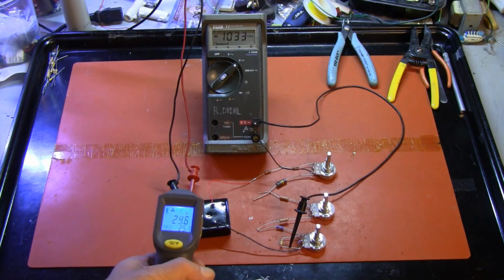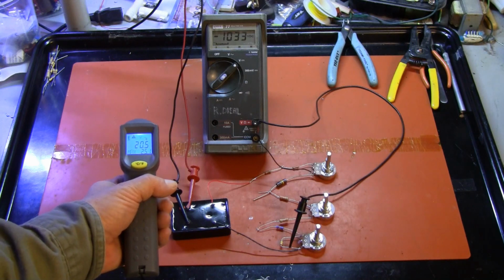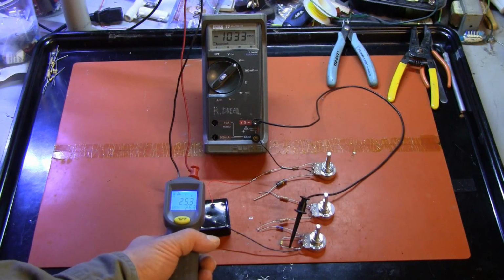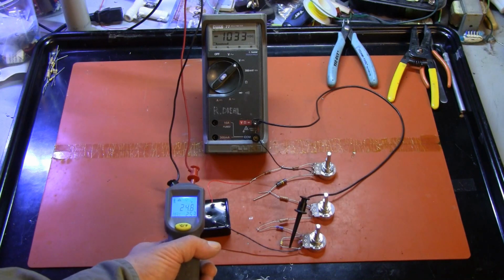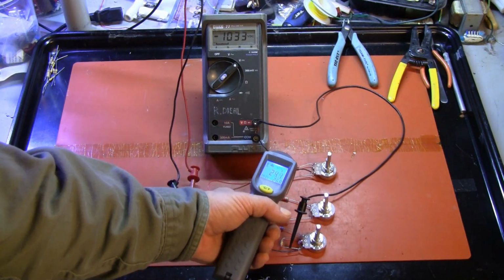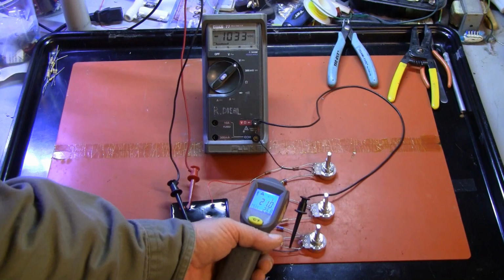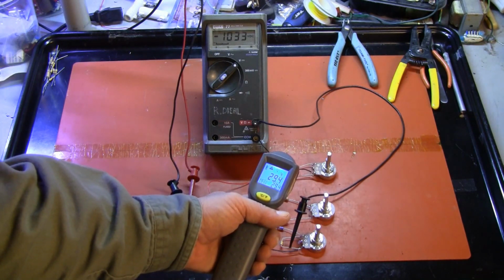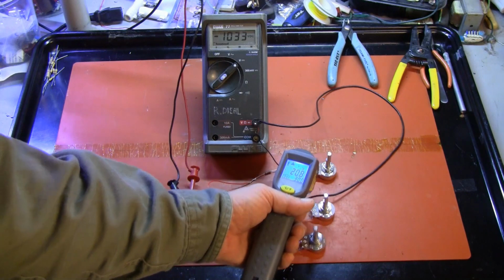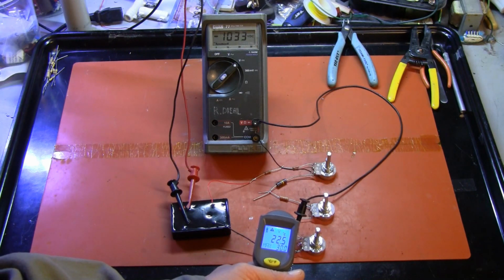We look at our power supply here. Well, first let's see what ambient is. Ambient temperature here is 20 and a half degrees Celsius. The power supply is running 4 or 5 degrees above that and is relatively steady. Looking at our resistors, they are running a couple of degrees warmer than ambient as well, but virtually undetectable to the finger, which I am not sticking in there, ground or no ground. So as you can see, we're not overheating anybody. We're in very good shape here.